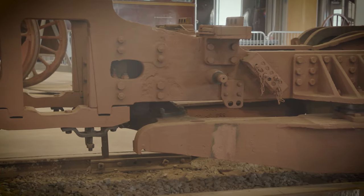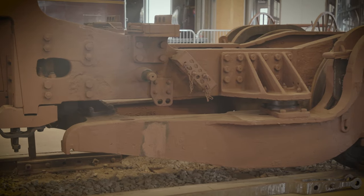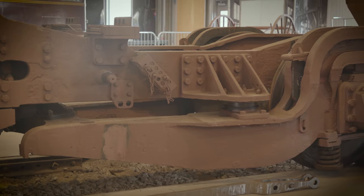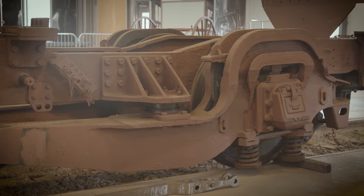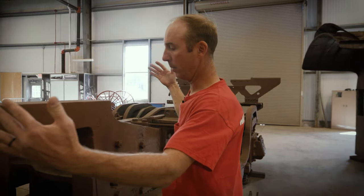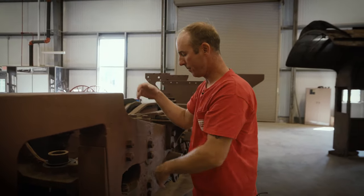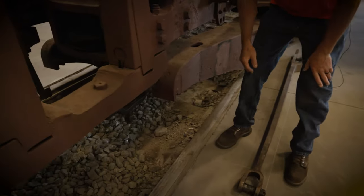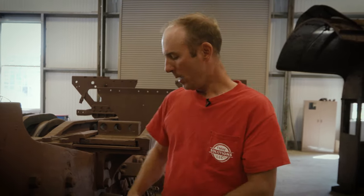This particular design trailing truck is unique in that it pivots from a center pin, as any other two-axle trailing truck. But what makes this trailing truck interesting and different is that the truck frame itself is part of the equalization system. You have leaf springs that go over the top of every bearing box behind the large driving wheels. On the back end of the springs on this locomotive, you had drop-down hangers — essentially two bars — that connected to the front end of the truck frame. So the truck frame was actually part of the equalization system.